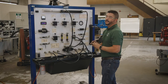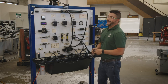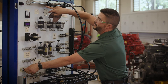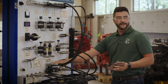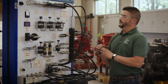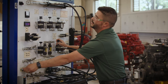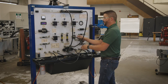Make sure you have your safety glasses on and we're going to turn on the circuit. So now the circuit's on — it's kind of anticlimactic right now. All it's doing is oil flowing in, going through this directional control valve and going to tank. Right here I have a switch that will allow my cylinder to move in and out — that's what we built with the directional control valve. In order to set the relief I'm going to have to make that cylinder go all the way to the end of travel. You'll hear a different noise when it gets there: while it's moving it makes one noise, and when it gets to the end of travel you'll hear a change — that's the motor working harder to send the oil through my relief valve.